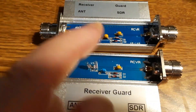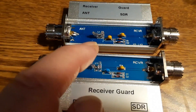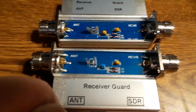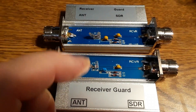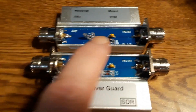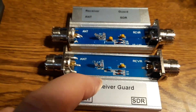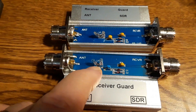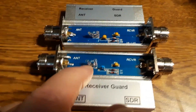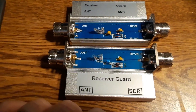They're sold on the internet at about twelve dollars plus shipping — shipping from China is about three dollars. Be very careful if you order any of these online, because some will actually work and others won't work at all unless you replace the neons with incandescent lamps. Typically these are 6.3-volt lamps with wire connections rather than a screw terminal type.